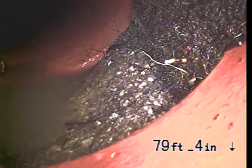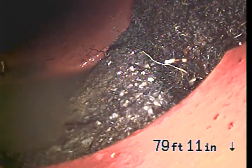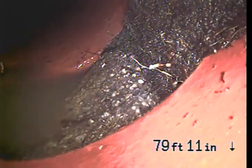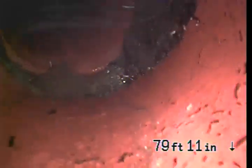That's a disconnected pipe, guys. See the worms and the maggots and all the stuff moving around? That is a disconnected sewer line, and this looks like our 4x6 transition. That's where all the dirt was coming from. It's our 4x6 transition.